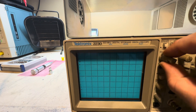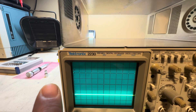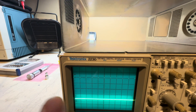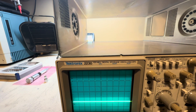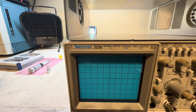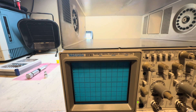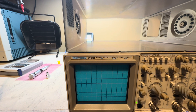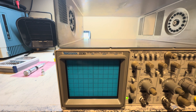Here are your markers, and you can see them right there. This part of the calibration requires the markers to be lined up right on the lines from beginning to end. If they're not, you adjust the pod to bring them into alignment. Once that's done you move on to the next step. So the workaround is: use a decent pulse generator that's within calibration and use it as a time marker generator to do your calibration.